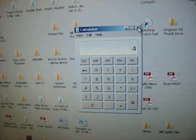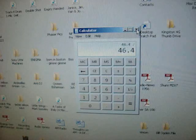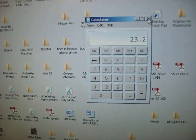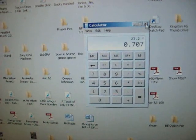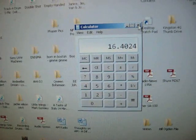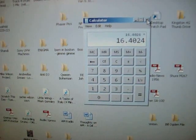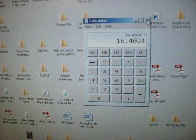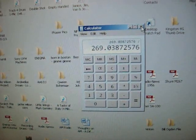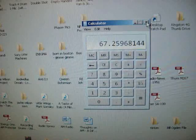So let's do some power calculations. We have 46.4 volts peak to peak. We divide that by 2 to get 23.2 volts peak. Then we multiply by 0.707 to get the RMS value: 16.4024 volts. Now we square that by multiplying it by itself — that's E squared over R, that's how we get power. Then we divide that by 4 ohms, giving us 67.259 watts.